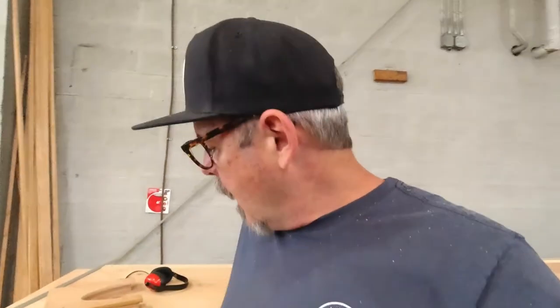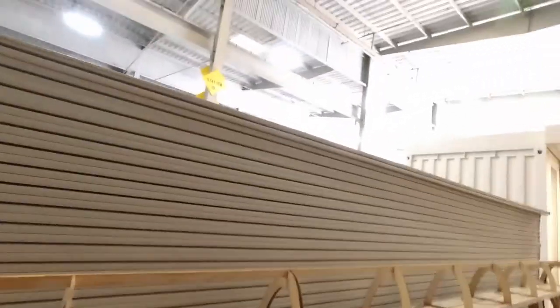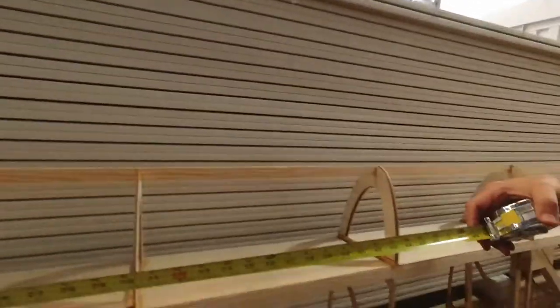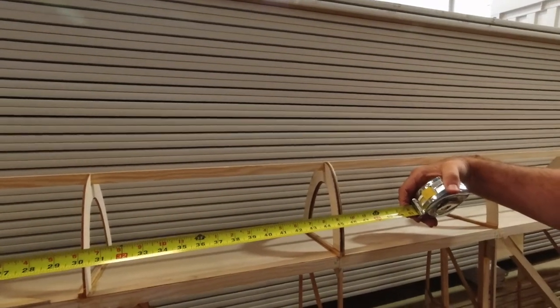So what I'm gonna do is I'm gonna measure off and cut two more pieces at 44 and a half inches. Let's measure one more time just to be sure. This was my shortest distance, which I believe was 45. 45, okay. So yeah, 44 and a half works. So, all right, I'm gonna cut two pieces that are this 11 and a half by 44 and a half. And then we can keep building. Sorry. All right, cool.